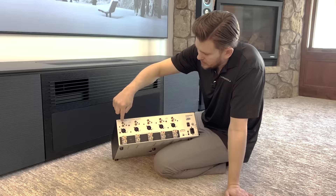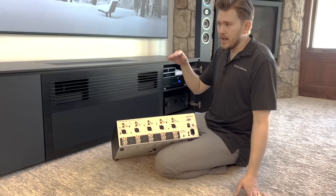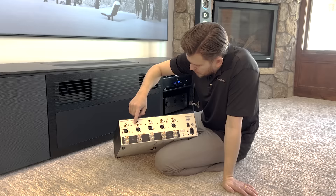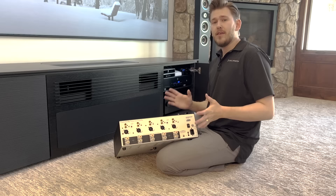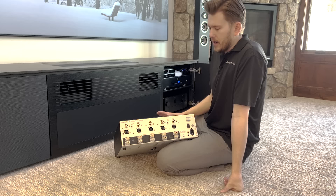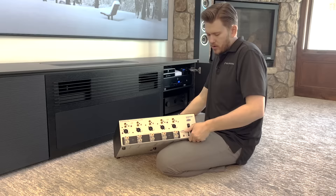What we're going to be doing is taking the audio out of the pre-out of the Marantz and amplifying it, outputting the signal with no amplification out of the front soundstage and surrounds through RCA. We're going to select mono on all of these — you can do stereo as well. We're going to take our pre-outs into our RCAs, and if you have a higher end amplifier you would connect to XLR. Then we're going to connect our speaker wires going out to the speakers on all five of our bed layers: front left, right, center and surround left and right.